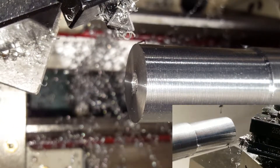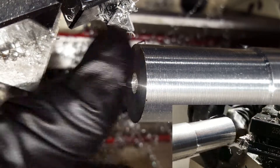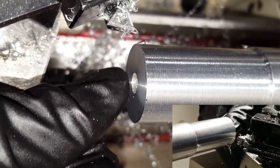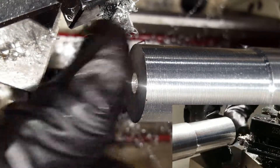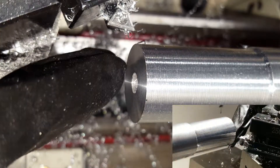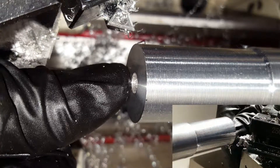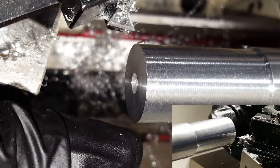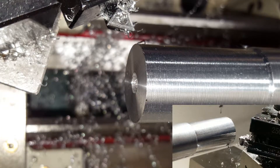And I have a completely smooth surface. I can see that the tool has touched the entire diameter going across, and it is a very good finish. That is how you do basic facing on a workpiece when using a lathe. For reference, this is aluminum, so this is very easy to machine. If this video is helpful, please like and subscribe for more helpful do-it-yourself and how-to videos.